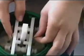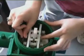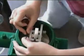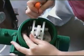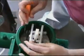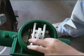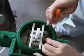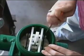Now push a spacer washer and a retainer washer over the end of the actuator pin and into the groove. Pull the motor piston up so the valve actuator arms are in the up position, and install the two tension spring bands onto the rollers on the valve actuators. Be careful not to nick or damage the bands on the installation tool or mechanism during the installation. Install the pressure plate over the stops.